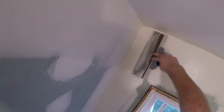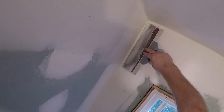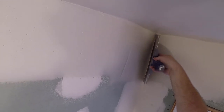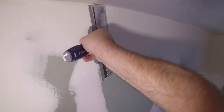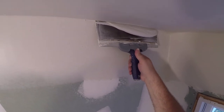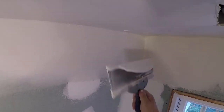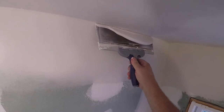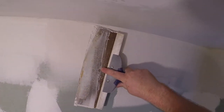Just bumped that. So that leaves a little divot. You gotta fix it. We're gonna be coating spackle again. Corners are always tough because you did the top, and now when you're doing the bottom, you're digging back into the top, so sometimes that causes problems. You just got to do the best you can, take your time, try to do it nice, no need to rush, because some dude sits in the truck all day, doesn't know how to charge, telling you got to rush, do the job wrong.